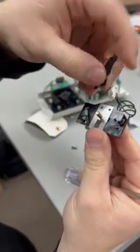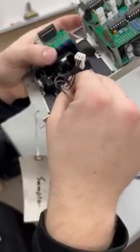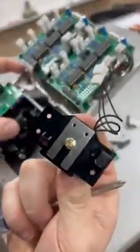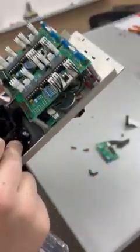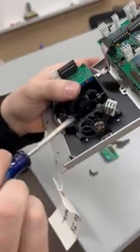Bend this piece down, the black piece comes off, and your spring will pop off. Take your whole assembly and put it right back into place. Now — something I didn't mention on the first one — there is a flat side to that shaft, and there is a corresponding hole with a flat side in there. These can only go in one way, so you just need to install the flat side in the same orientation from the pot assembly to the main part of the joystick.